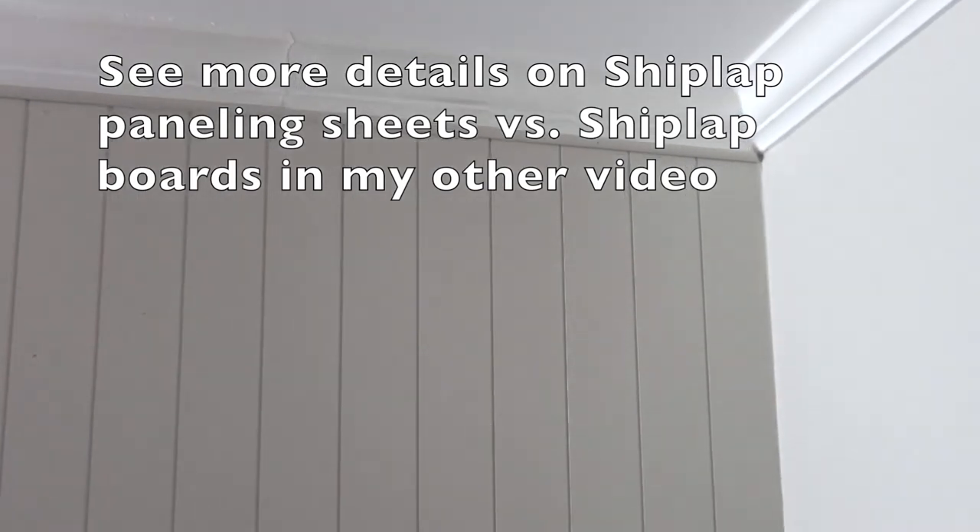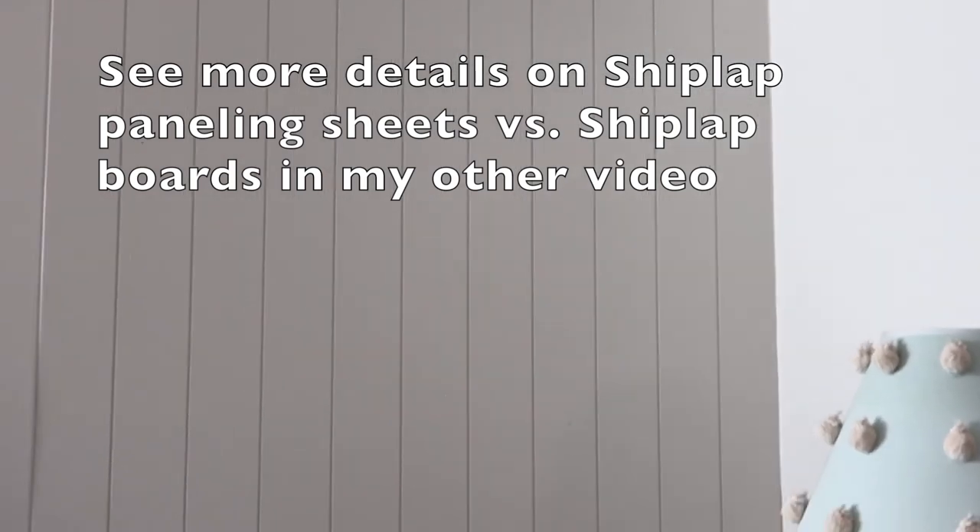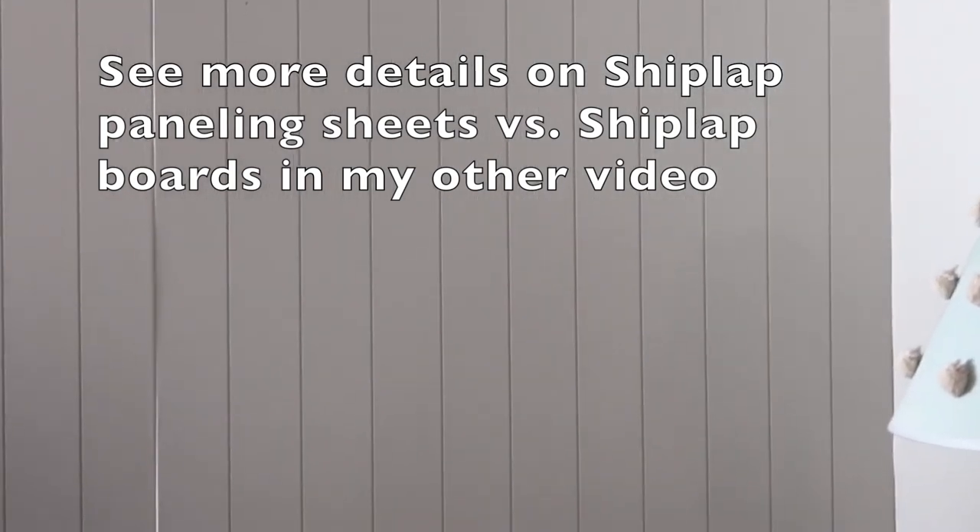It looks really good — I love the paneling, love the way it looks. My only complaint is that the seams where the panels meet sometimes aren't super straight. And even when I try to put nails in panels that aren't super straight, if it's not in a stud it's still going to kick out and give a little bit of a gap. At the top you can see where I added a little bit of shoe molding, and I even angled the cut on the side to match the angle of the crown molding at the top. Then I just caulked along the edges.